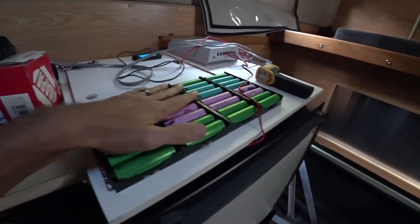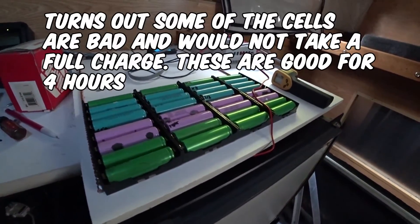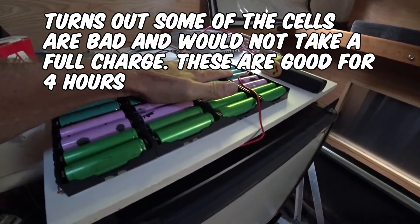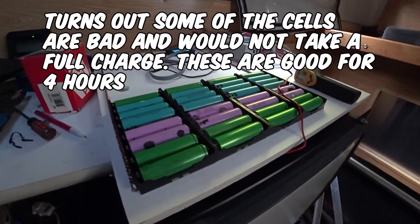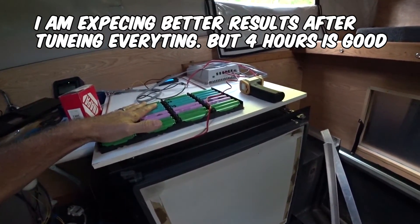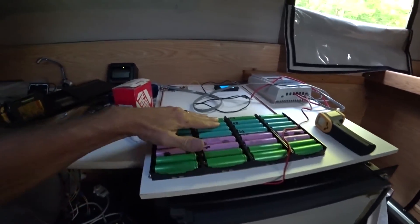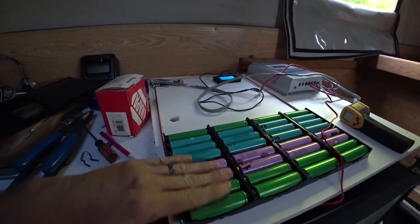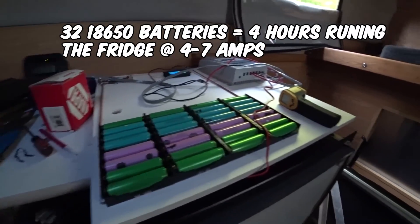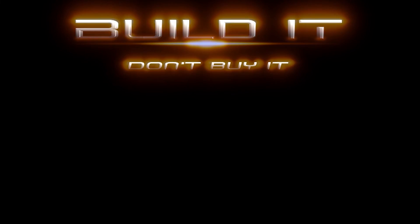It's time to do another test — I want to equalize these batteries and retest. These are old laptop batteries and they're not going to take a full charge. Once I get them equalized, measured, and bad cells removed, I'll be able to tell a lot better. But that's proof of concept, and it's going to take way more batteries than I have here to drive everything. There are one or two cells that are a little bit warm, but everything else is pretty cool. Making progress — thanks for watching, please subscribe for future updates. Remember: build it, don't buy it!